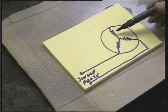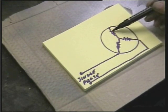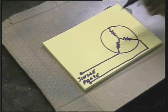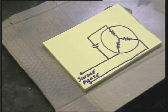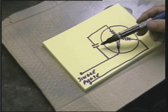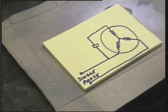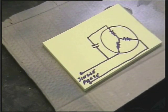So what about this third coil — how can we bring this one into operation? We can't do the same thing, because it will end up being in sync or in phase with one of the other two. So the opposite of inductance is capacitance, so here we are going to bring in a capacitor. As this is drawn, this motor will run, though it may not start by itself — it may just sit there and buzz, but if given a good spin it will continue to run. The value of this capacitor, or condenser, wants to be about 20 microfarads per horsepower. There is no hard and fast formula here; it is experimentation, but something in that region will put you in a good start.